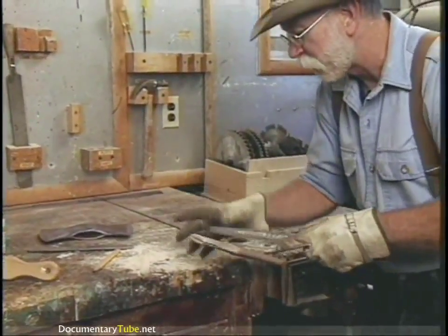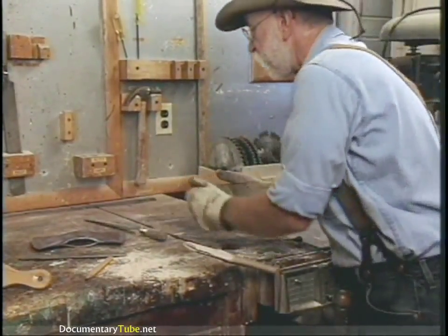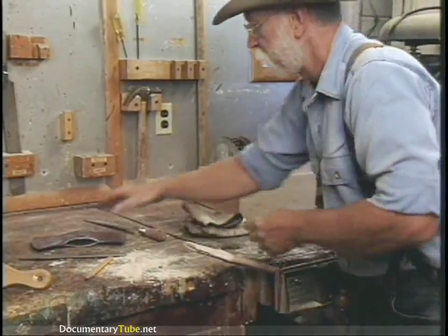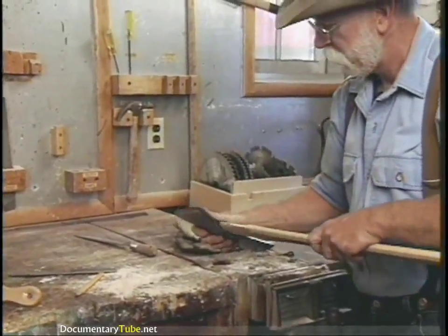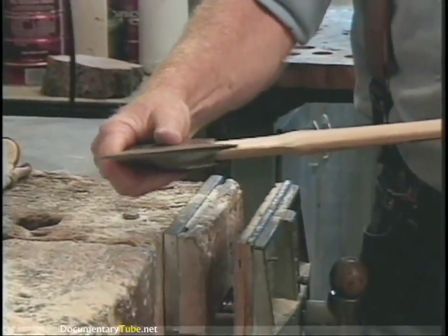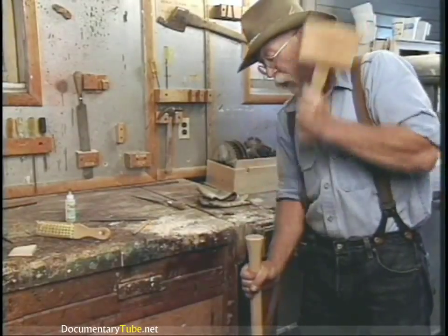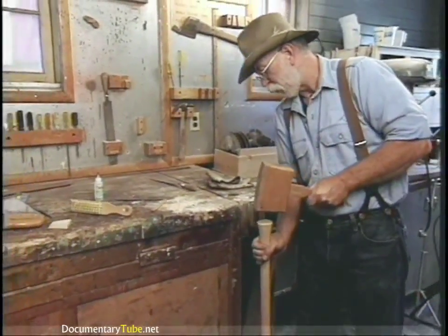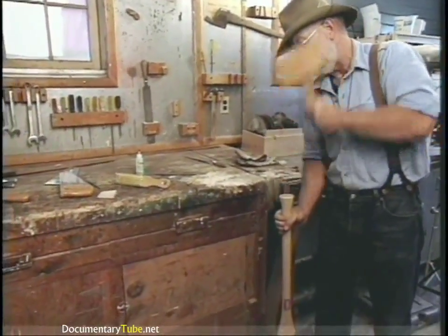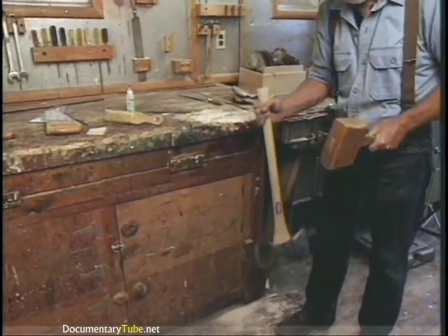It's time to give it a try for the first time, but I'm going to bevel this edge just slightly to help it slide into the eye on the axe. Let's take it out, start it down in there, get it snug, turn it upside down, take your wooden mallet, hit it good and square, hold it up in the air like this. You can hear it, you can feel it. I can even feel when it stops, when it shoulders up. You want to hit it good and square so you don't split the swell out.